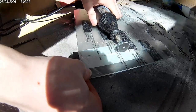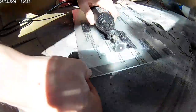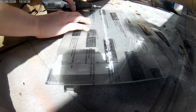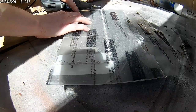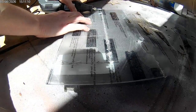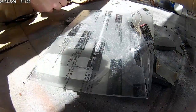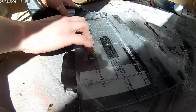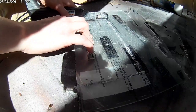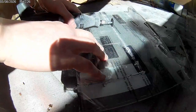It'll take a while because you want to be pretty slow and steady. I've had the most success with treating it sort of like a miniature table saw — I'll take the Dremel and sink it through one end of the material, then push the plate through the Dremel while holding the Dremel steady. It's just a matter of taking your time and making sure you're actually cutting entirely through. You guys get to experience this at six-times speed, but this is going to take a very long time, and this is probably the shortest step.